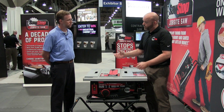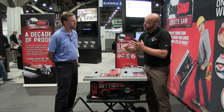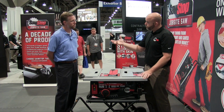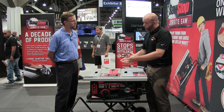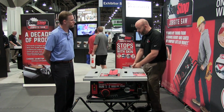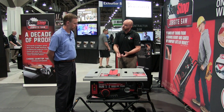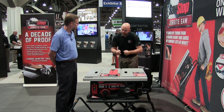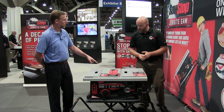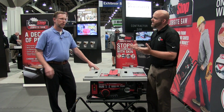That's one thing I didn't talk about, was that below table dust collection, where we're using the turbulent air from the blade and shaping the dust and taking it out. You may have noticed with the one that you guys have in your shop there, where with our saw, you're not going to get that dust falling here. It's not going to even fall here. It's going to stop about 3 feet out the back of the saw if you don't have a bag on there collecting it. We're taking it all out of the saw and giving the user an opportunity to collect it. And the port size on the back for hooking it up is 2 1/4 interior dimension, 2.5, 2 1/4. So yeah, it's that standard size.